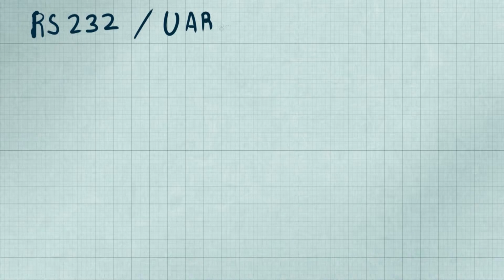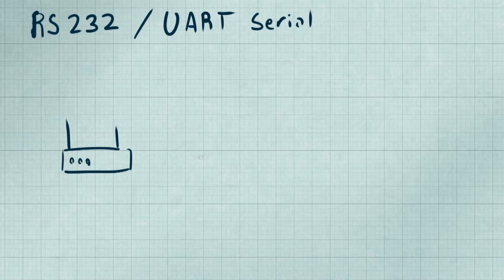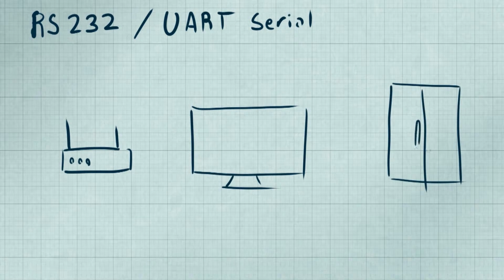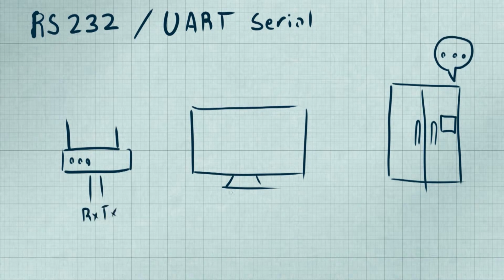Obviously, this method isn't new, the most widespread use of it being the RS-232 protocol. Though you won't see the RS-232 serial ports on most devices nowadays, they've taken a backseat role in hardware. You can still find RS-232 style serial in TTL 5 or 3.3 volt levels on other devices. Things like routers, game consoles, TVs, Twitter-enabled smart fridges will likely have an internal connection allowing for low-level command access and debugging straight to the microcontroller.